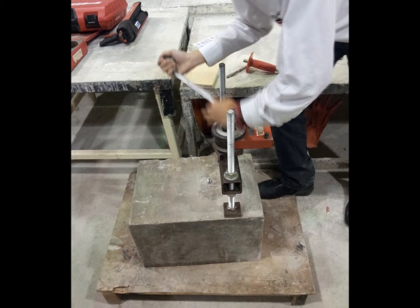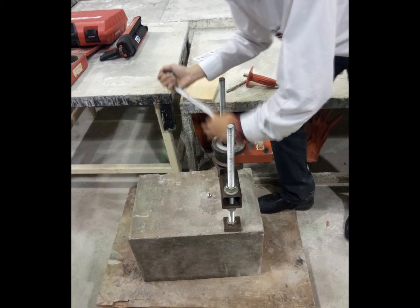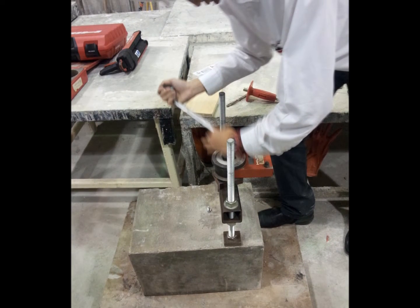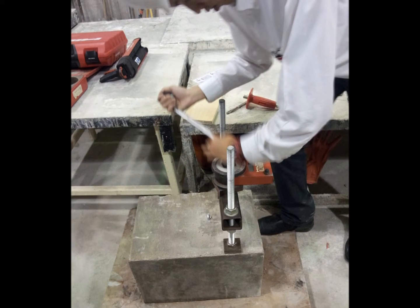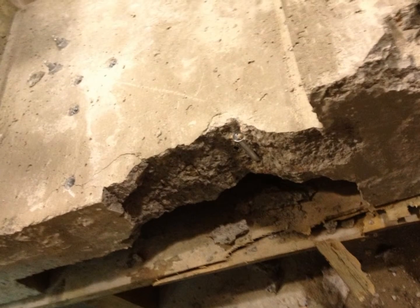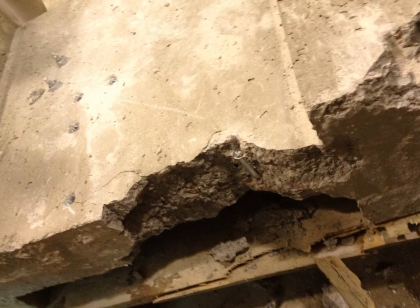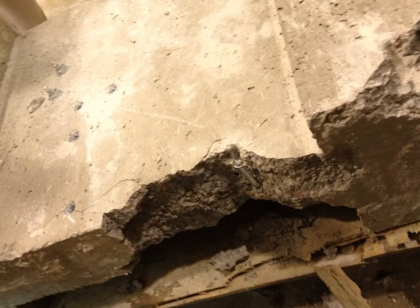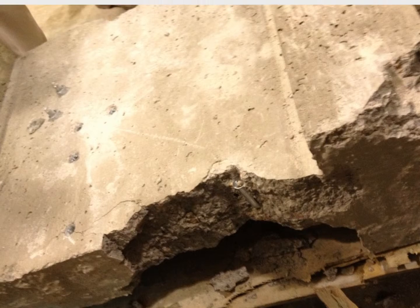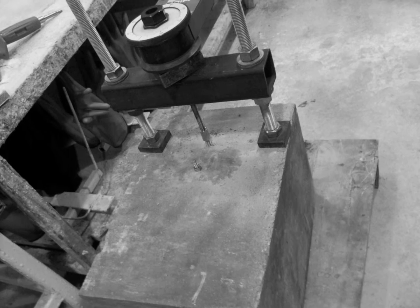Part 2. Anchoring. We have opportunities to learn different kinds of anchors. The tutor first demonstrates once, and then we follow his installation skills to install the anchor. Due to a structural design problem, the anchor was installed too close to the edge of the concrete. The failure of concrete occurs. Here is the failure of concrete. Finally, we try to pull out the installed anchor by machine.